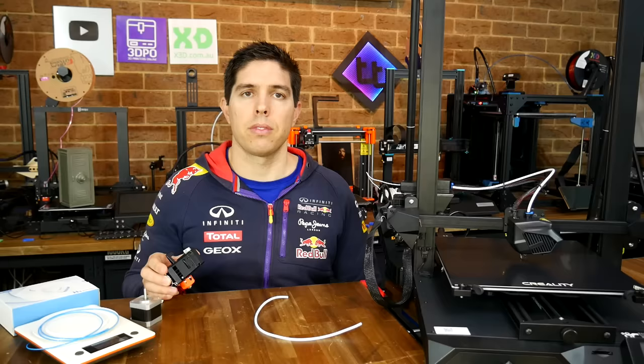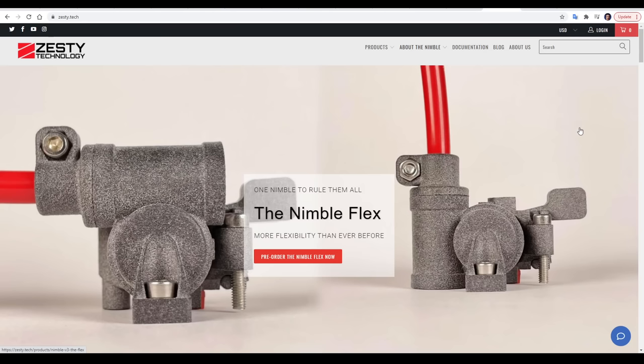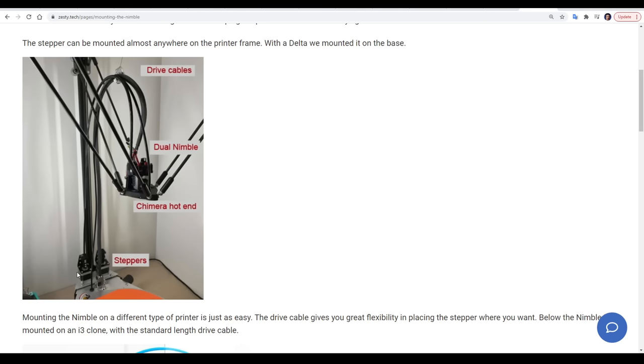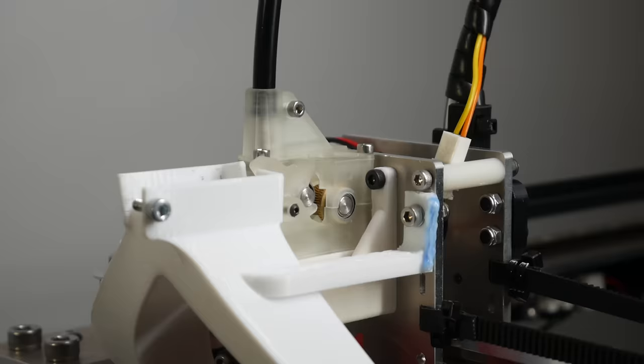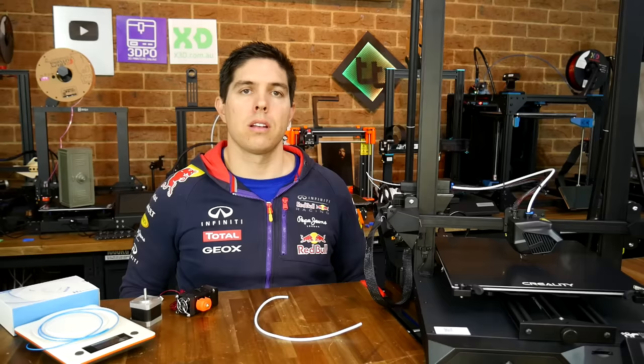In short, recent Direct Drive developments minimise compromise, offering precise filament control as well as relatively low mass. You might also be wondering if there's a third option — a hybrid between Bowden tube and Direct Drive. The answer is yes. Available for a while now, we have the FlexDrive G5 and the Zesty Nimble, with each design aiming to combine the best of both worlds. We mount our extruder stepper remotely, just like with the Bowden tube, but then use a long FlexDrive cable going into a very minimal and lightweight extruder drive which is extremely lightweight due to its minimal parts. On paper, this approach should be the best setup, but for whatever reasons, popularity remains limited.